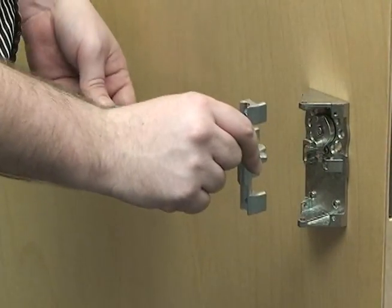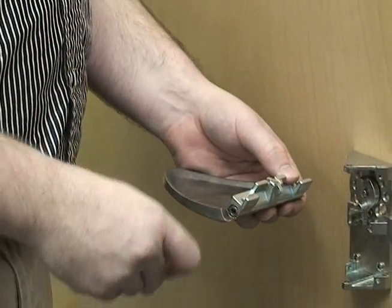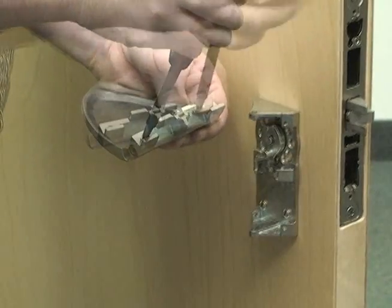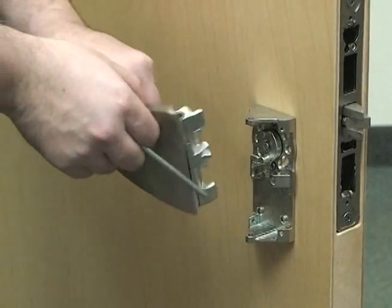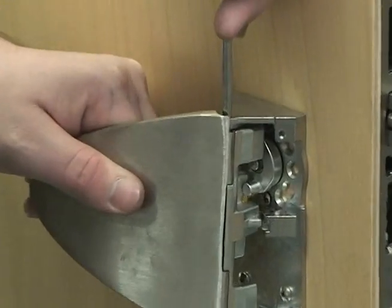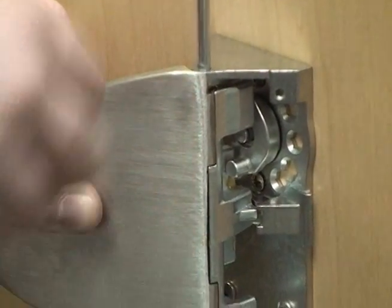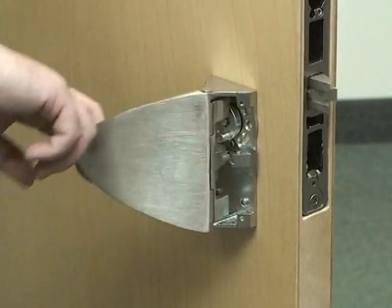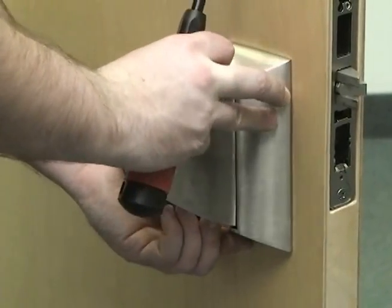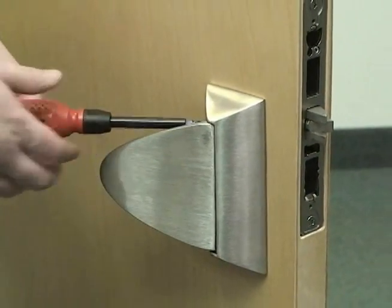Identify the desired paddle orientation and secure the insert on the paddle with the supplied screws. Attach the paddle to the chassis by aligning the top side of the paddle with the pivot hole. Then, insert the axle through the pivot hole in the chassis and push the bottom of the paddle in, so the axle goes through the top and bottom pivot holes. Install the cover using the oval head mounting screws. Be certain the cover holes are positioned underneath the paddle.